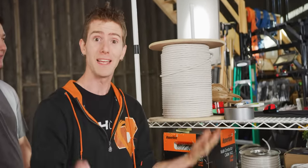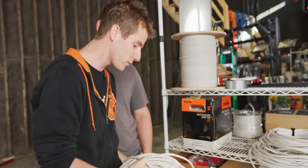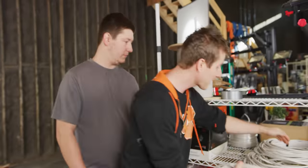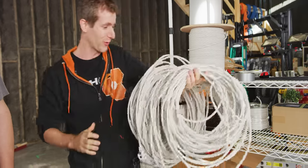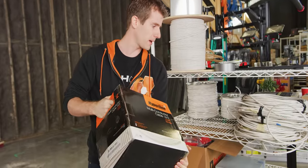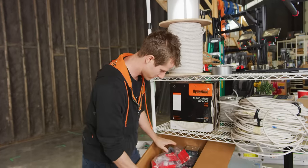But the good news is, even though we didn't get the right wiring, we found this spool of Cat 6A. It's a nightmare to work with, but that's okay because we're terminating into Keystone Jacks this time, so it should be a complete non-issue. And I found all the old runs from the old office, up in carabiners screwed into the ceiling, running from the bottom floor up to the top floor. Finally, speaker wire. We're gonna wire the whole place up for sound, not necessarily knowing exactly what we're gonna install and when we would do it. Oh yeah, more cool stuff.